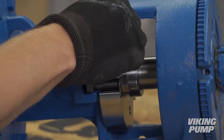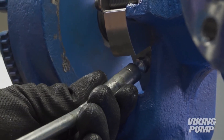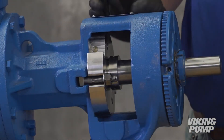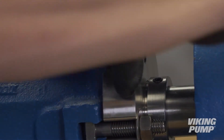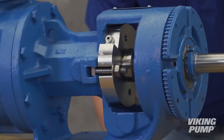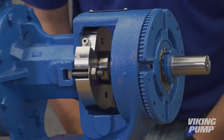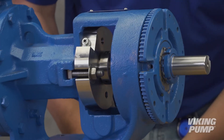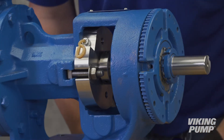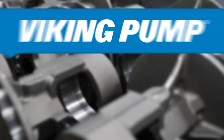Remove the grease relief fitting from the gland. Grease the gland until grease comes out of the open hole where the grease relief fitting will go. After cleaning the excess grease off the gland, use thread sealant to insert the grease relief fitting into the open hole and tighten. Re-grease the gland until sufficient grease comes out of the grease relief fitting to ensure all air has been purged. Rotating the shaft while greasing will help remove trapped air. Regular re-greasing is required, and discoloration of grease coming out of the relief fitting is an indication that O-rings may need to be replaced. Your pump is now ready to be re-installed. Thank you for watching!